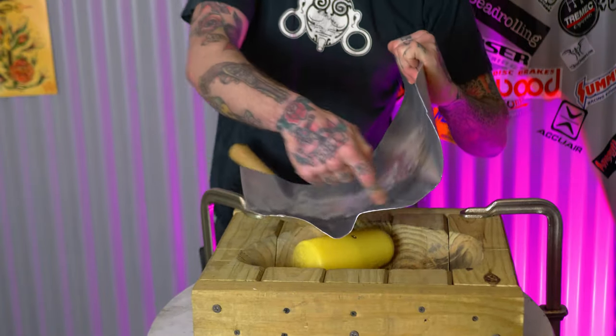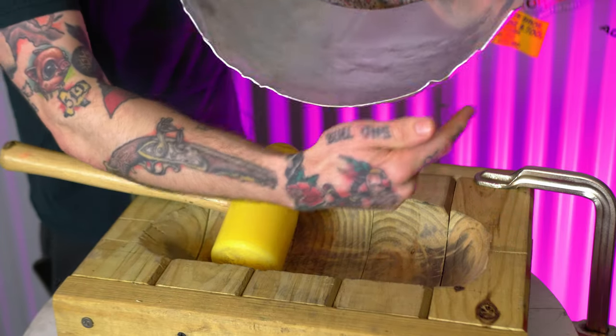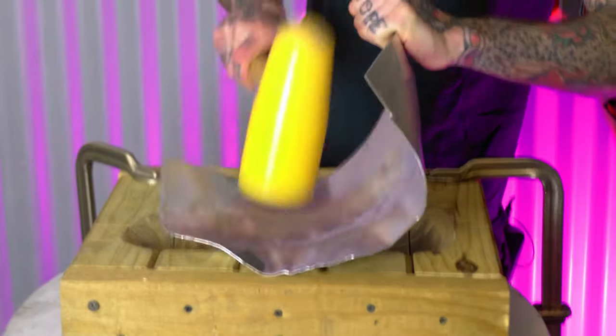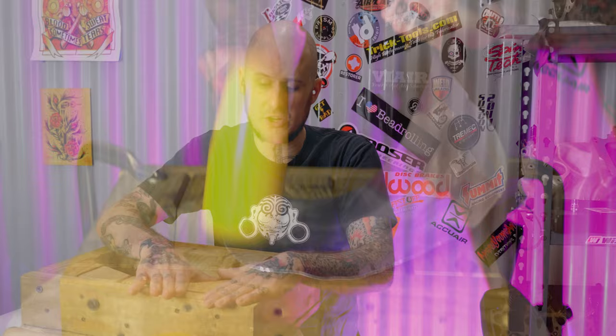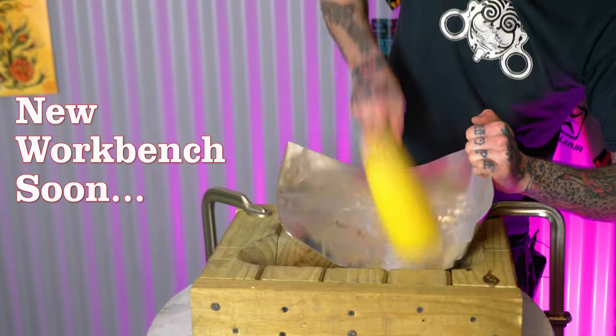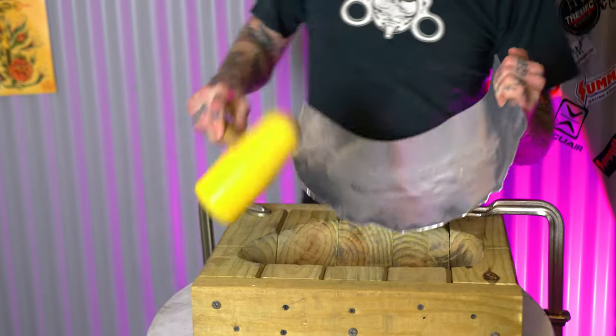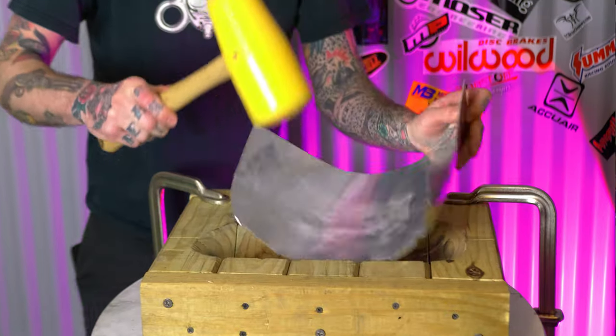You can see this piece of sheet metal I was shaping in the shot bag. As I shape it, creating stretch, you can see that the edges of the panel start to wrinkle up — that kind of potato-chippy wavy pattern — and that's what I want to see for shrinking. I'm going to take those wrinkles, set them onto a flat section of the stump, and use the bossing mallet to strike onto the top of that wrinkle and gather the metal in on itself. As it digs into the wood surface it doesn't just flatten back out like it would against metal — instead it gets stuck on the wood and forces itself in on itself, gathering more surrounding material. So a piece that started at 0.045 inch thick could end up at 0.046 inch thick — it's actually creating thicker material.